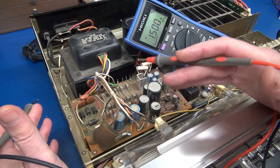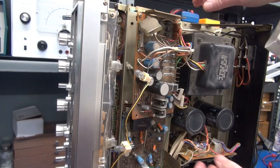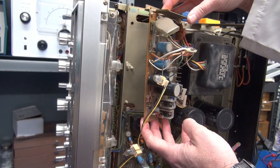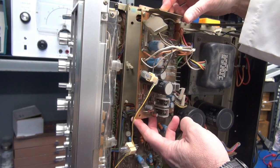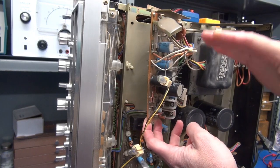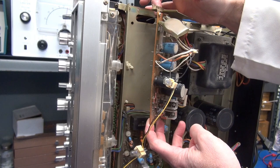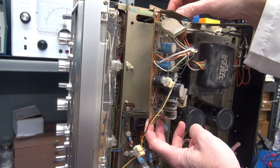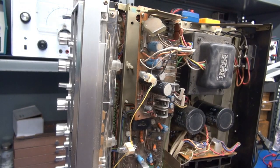So is the Pioneer able to power up? Not yet. I've taken out a few screws and I'm able to pull this board out enough to gain access to the foils of those diodes, but she's a little tight. The last thing you want to do is force this. I'm probably going to prop the board up and get back there to desolder those guys, put in some fresh diodes, and see how things test then.